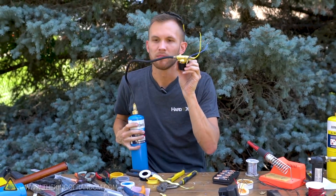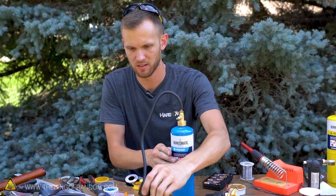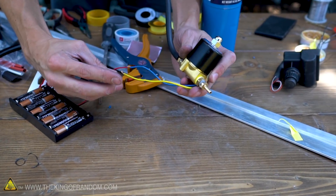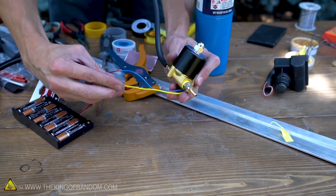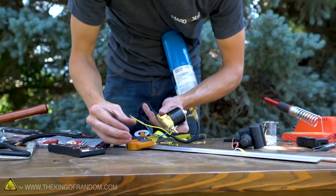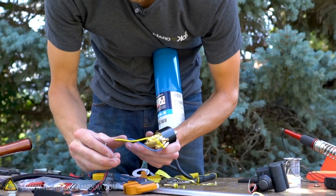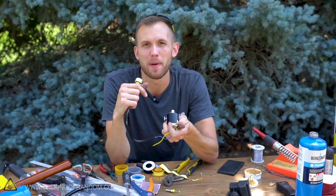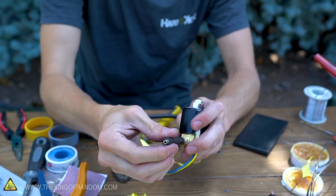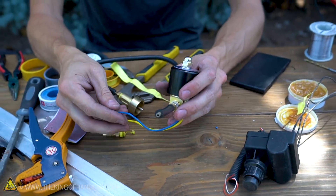It's attached to the tank. I don't hear or smell any propane leaking out. Let's attach this to our battery pack and see if it suddenly lets out a burst of propane. Yes — quite a bit, in fact. All right, one more thing — we're just going to try turning this upside down and see what kind of spray we get. That is a lot of fuel dumping out at once. We have propane spraying out the nozzle, though it's a little close to the solenoid — we're probably going to want to add more hose onto the front so we have some control beyond the solenoid itself.